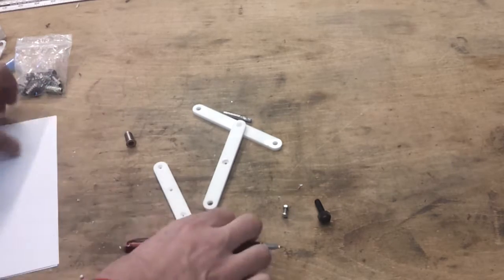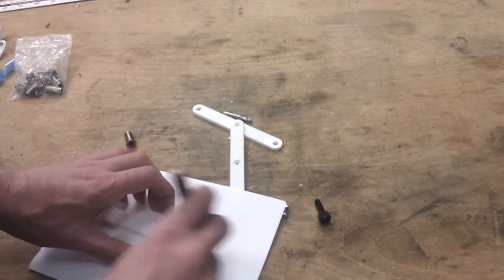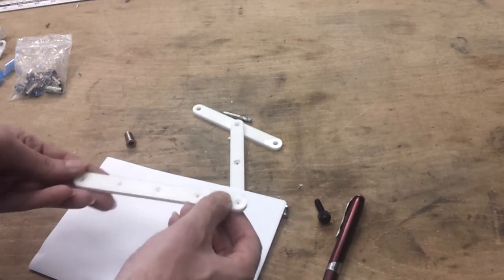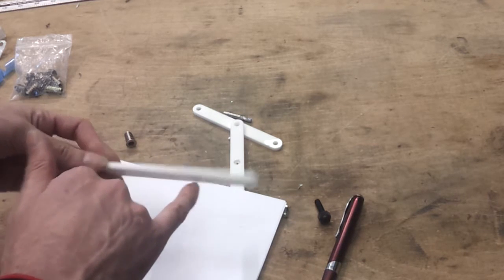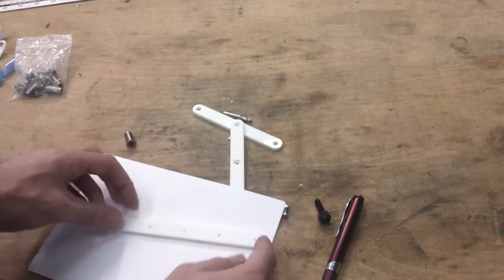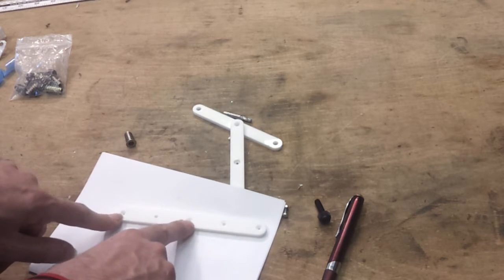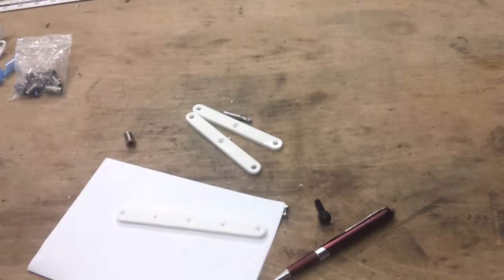And I think these marking holes, yeah, they need to be a little bit deeper, so I'll just take them down a little bit more. I think I took them 3mm and I need to go down to about 4, and then this counter bore needs to be on the other side, so I'll put that back in, just take those two counter bores down, cut these slightly deeper, make sure that the pen goes in and leaves a line, and then we'll do the wood.